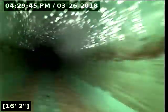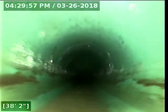At 10 feet, we now transition from ABS to 3034, which is a type of PVC used in sewer lines. You should be seeing the sewer line main here soon — and there it is. At 49 feet, we have hit the city main.